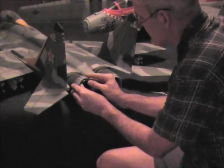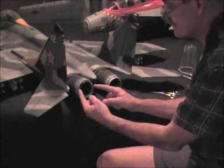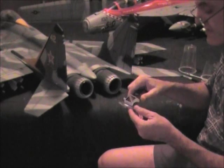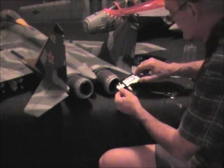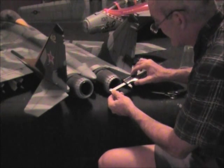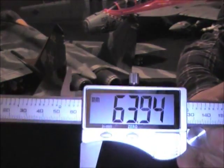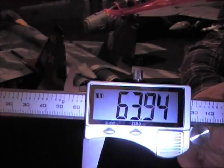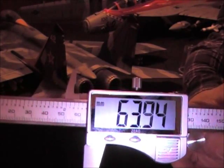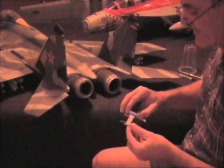Then I'll get it in there and fit it to the thrust tube nozzle. Most of the exit diameters on the LX twin jets is about 65 millimeters. It's nice to have a pair of calipers so that you can measure it. I've already got it marked so I know where the widest point is. That is the exit diameter we have, and we want to bring that down to a number that will give us more thrust — somewhere around 55 millimeters. Wemo recommends between 55 and 58.